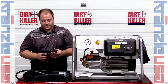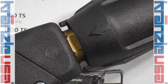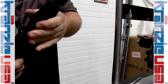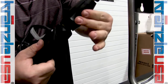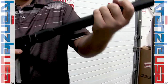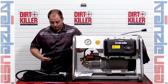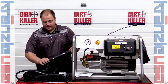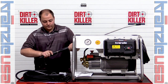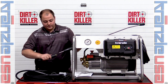What's different about this accessory package is it comes with a bayonet style quick connect. Right here we have a locking collar — it slides all the way back from its position and can rotate. We take our high pressure lance, slide the locking collar back completely, insert until you hear a snap, and then rotate the collar slightly so it can't unlock while in use. This allows you to completely pivot anything attached — any accessory, lance, or tool. To remove it, turn the collar to the free position, push in, slide down, and the bayonet is free.